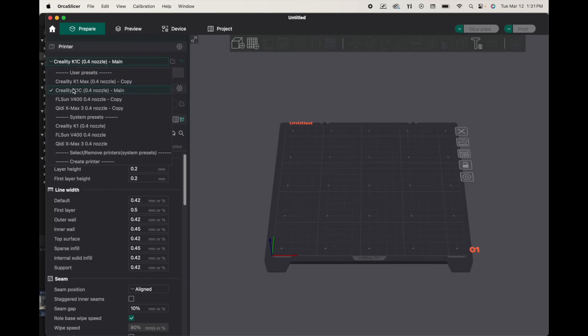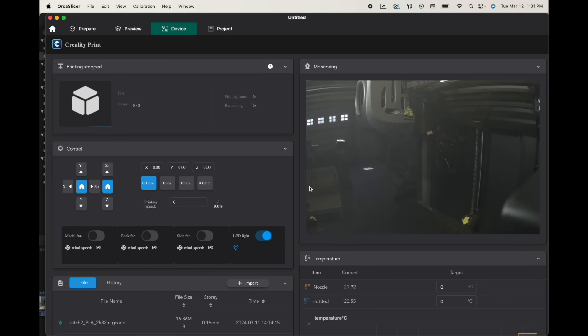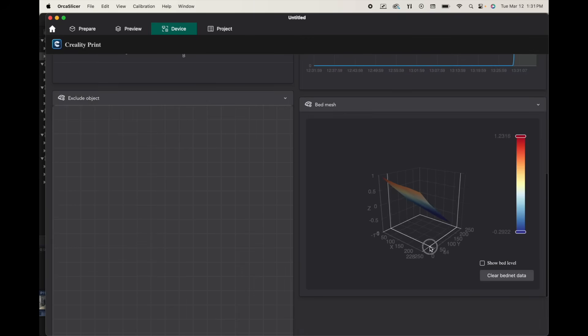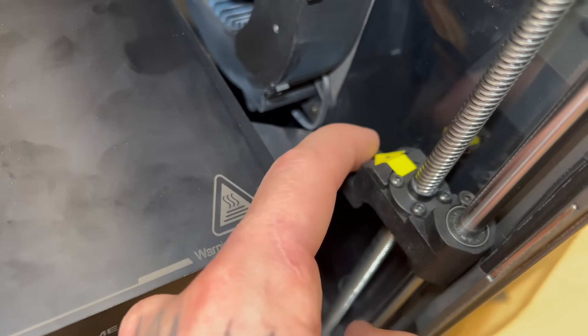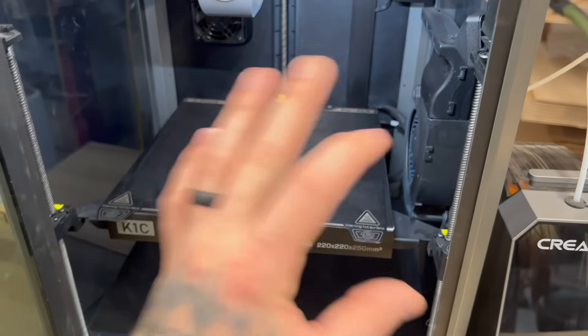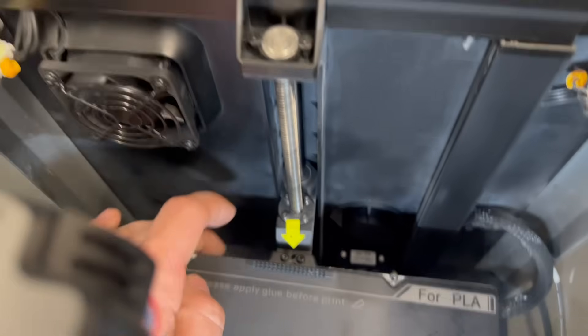Now hopping into Orca to show my bed mesh - I've been running the K1 Pro profile with no problems. Heading over into device and scrolling down, it shows your bed mesh. It's not all twisted and warped, but it does kind of look like a ski slope. So if I just add one of those half millimeter shims to the back, it should level it out drastically. I really wish Creality would give you adjustment knobs - I don't know why they make us go through all this hassle because it's a known issue. But this does look way better than my K1 Max bed mesh, though it's a way smaller bed. You take out the screws, 3D print a little shim out of ASA or ABS, put it under there, redo the bed mesh, and see how it looks.